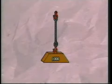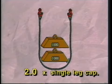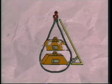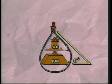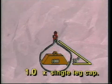To illustrate: the capacity of this single leg sling is 1,000 pounds — that's how much you can hang from it straight down. Take the same sling and make a true basket hitch, and the capacity is now 2,000 pounds, double the single leg. Now connect both ends to a common point and you've just reduced that sling's capacity. When the horizontal angle is 60 degrees, capacity drops to 1.7 times a single leg. At 45 degrees, it drops to 1.4 times. And at 30 degrees, it drops to 1.0 times — the same capacity as a single leg sling.